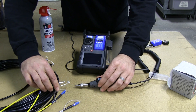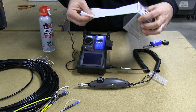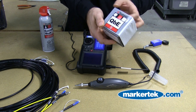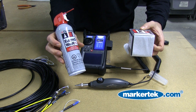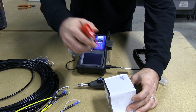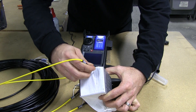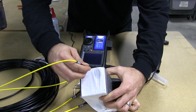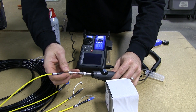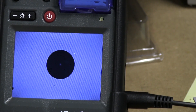The next step is to start with a fresh pad — because you don't want to bring any residue from previous cleanings — or at least a fresh area. What we're using here is the Chemtronics QBE wipes with their Electrowash PX solution. You just do a little dab in a corner so you have a wet area, and three times you're going to go across from wet to dry. Not too much pressure, but enough to make sure you're cleaning the residue off — three times. Give it a little bit of time to air dry; it doesn't need much. Then do a follow-up inspection, and what you'll see is a very, very clean fiber optic cable.